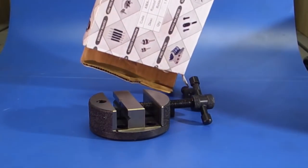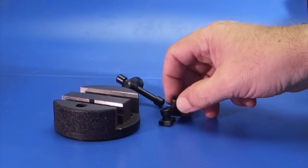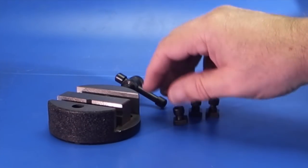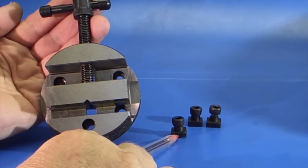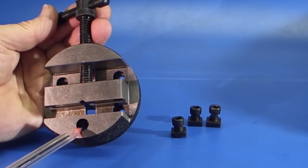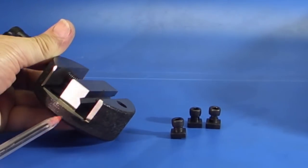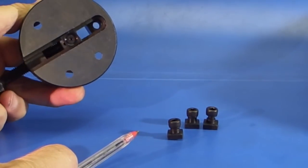Today I've got this small vise — it's a three inch round vise for a rotary table. It comes with three small T-nuts and cap heads. It's got three holes in the base that you can bolt your T-nuts to, and also an extra hole here, I think for a 6mm cap head. It's got a V already machined into it, and on the side and on the bottom it's flat.